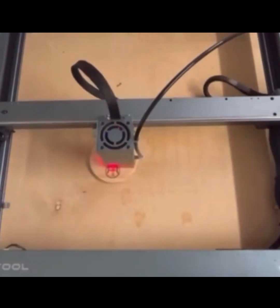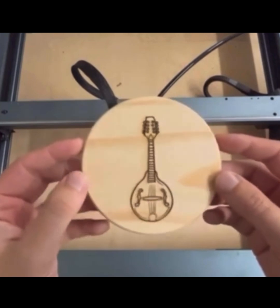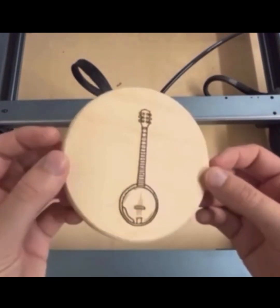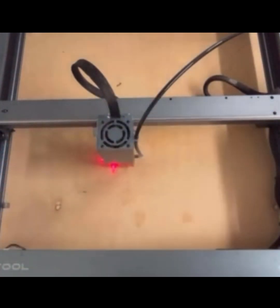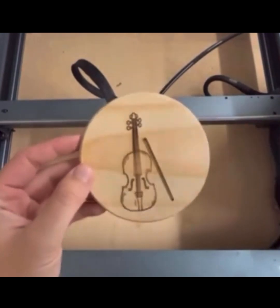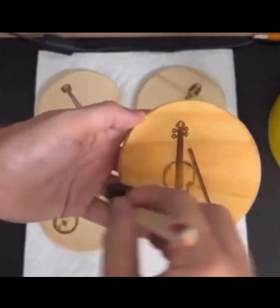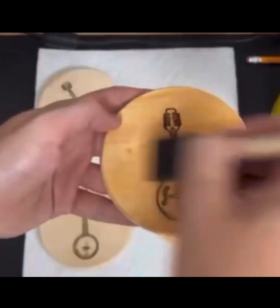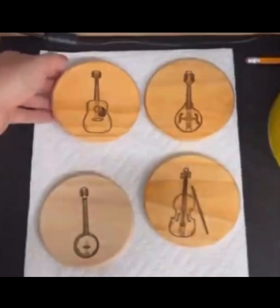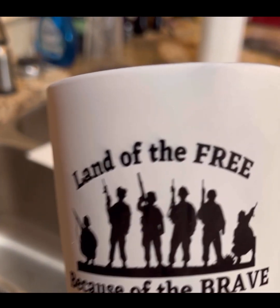There are a few different types of laser engravers, such as diode lasers, CO2 lasers, or fiber lasers. A diode laser emits coherent light — it stimulates semiconductor material to release photons, creating a laser beam for engraving or cutting materials. Diode lasers are relatively affordable and can be used to cut and engrave various materials. CO2 lasers use a high-powered CO2 laser beam to cut, engrave, or mark materials. They are relatively more powerful than a diode laser, but they are also more expensive.